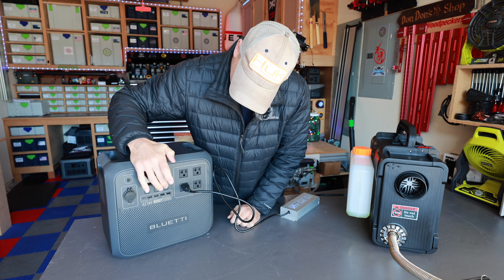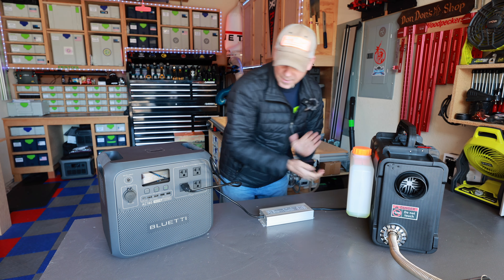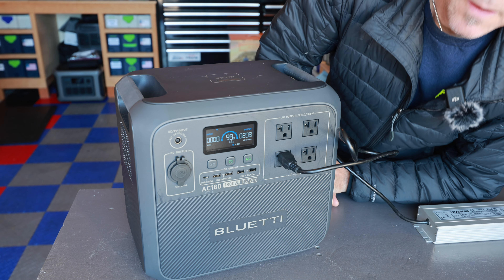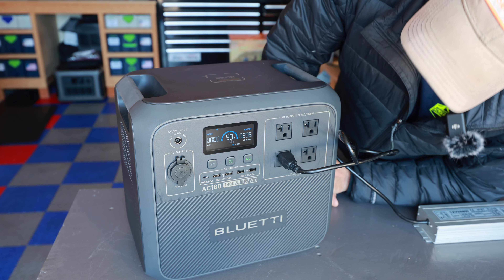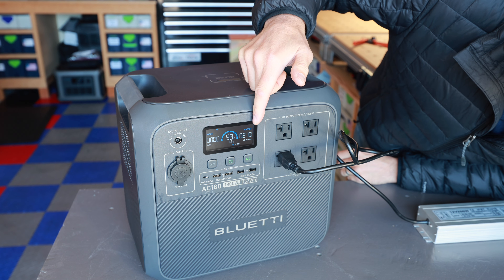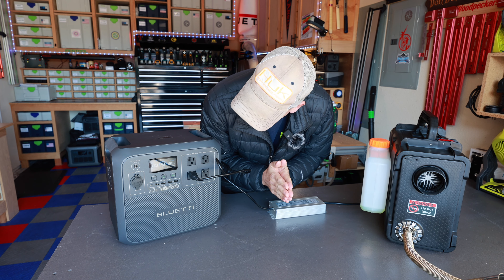Get my inverter cut on. Let's monitor this wattage. 110 watts. There's over 200 watts. Over 200 again — 221 watts, just for a brief second. Fuel pump starting to click. Over 200 watts — so far, so good. 248 watts. We are going still. This is set just a little bit above the middle setting, so it's not all the way up to max either.